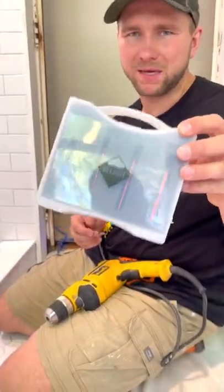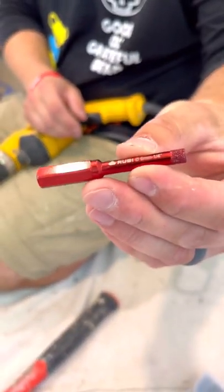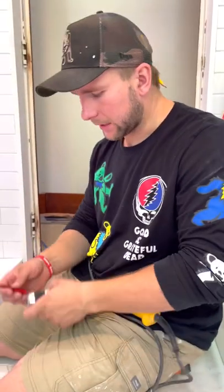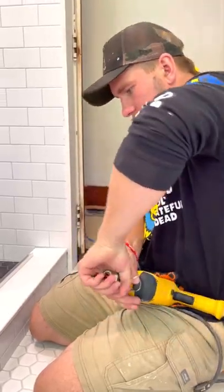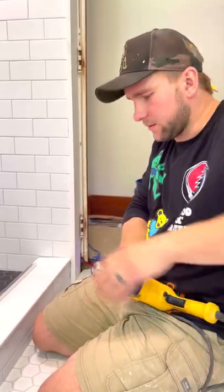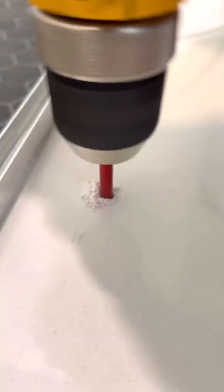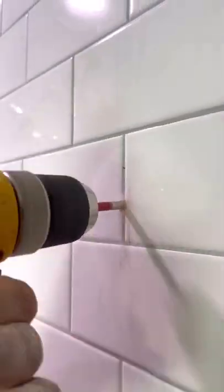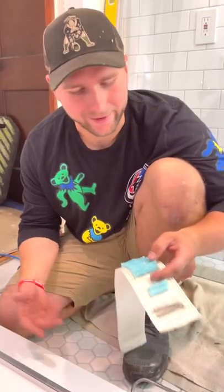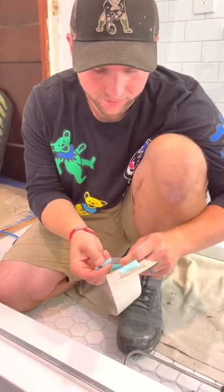I've got these Ruby bits — this right here is a quarter-inch diamond bit that I'm going to use. These are literally the sharpest bits you can get; it just goes right onto your drill. We just have to make these three holes — watch how easy it goes right through the tile. No water needed. They gave us about 40 of these anchors, but we just need three.